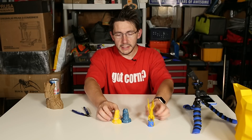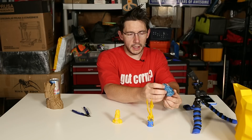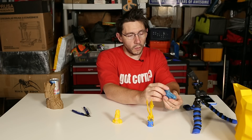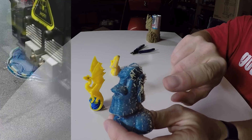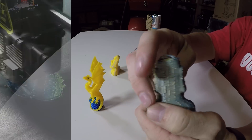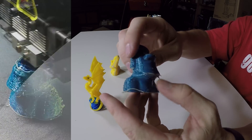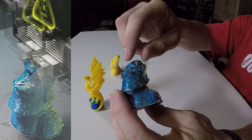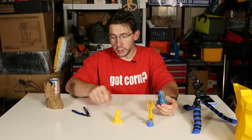And what I did was print one of the Moai heads — good old Easter Island — and the dual extrusion print, I think it came out well. It still has the ooze shield on it, and what you see right here is the bits of filament that oozed out of the nozzle being caught by the ooze shield itself. You can see that there's not a lot of blue bits from the blue filament, but the tan filament definitely oozed out and this caught it.